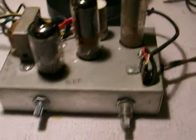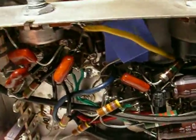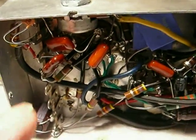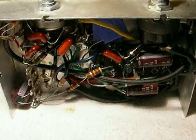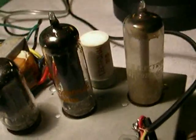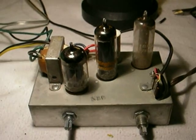Back to the amplifier — this really was a significant overhaul on this one. You can see down in the bottom here, all of this stuff down here is all added: the terminal strip, the nine-pin tube socket, all the components to add the two stages of amplification. The 12AX7 is the equivalent of approximately two 6AV6s in one envelope, so we're adding two more stages of amplification — one for the magnetic preamp, one is a follower for that. Then into the original — what used to be a 50C5 and is now a 35C5 because of the extra filament I added for the 12AX7. I dropped it from a 50C5 to a 35C5 so I didn't have to change the filament resistors. So this is the original amplifier shell for the record player, but it's been modified to take a magnetic cartridge, and it's pretty cool.